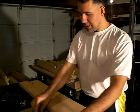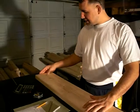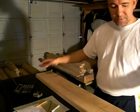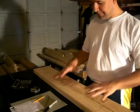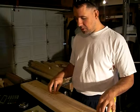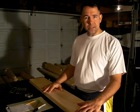So, as you can see, you want to measure and lay your pieces out properly, make sure you know which ends are the tops or the bottoms, and make sure you've got them faced the right way. Mark two out at a time — one for each wall — and do that for all your door frame pieces as well. It'll just help you speed up the process of your wall assembly.